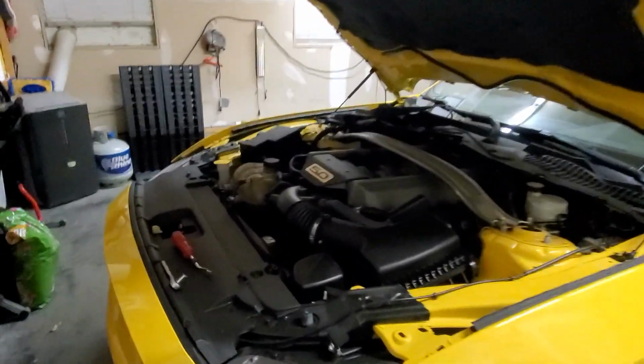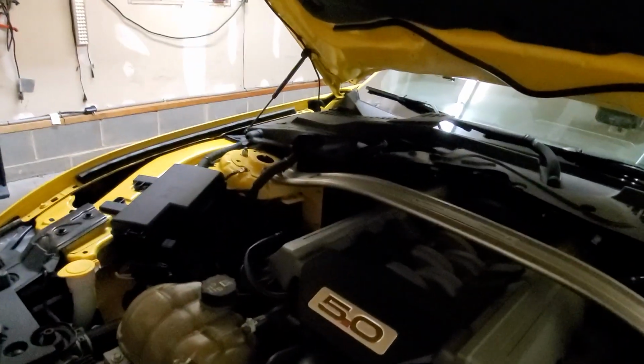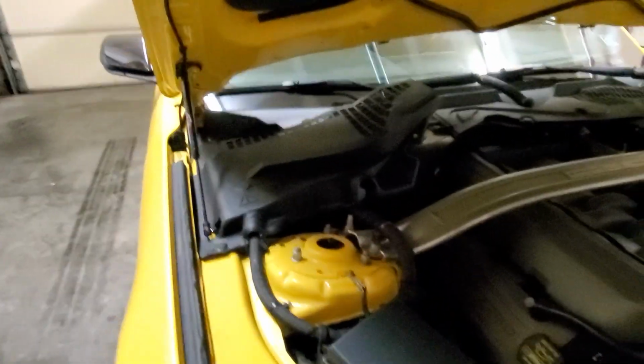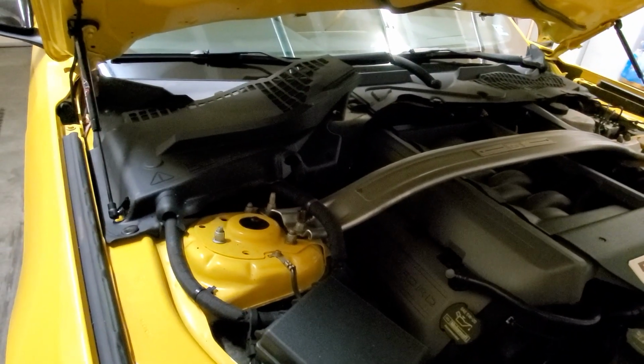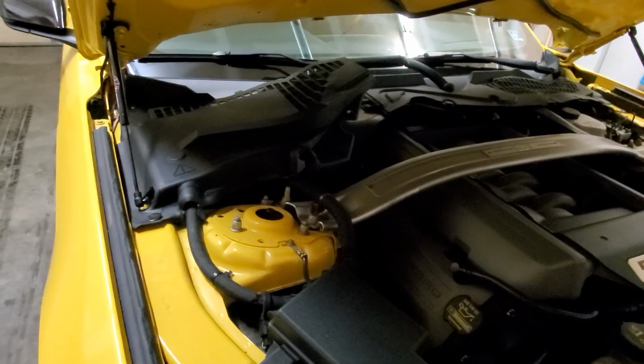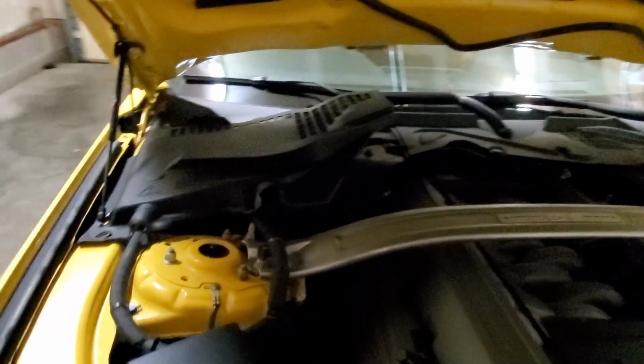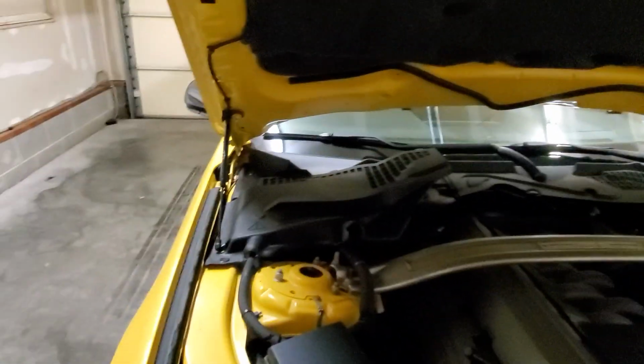Alright, that is what we're doing surgery on. The first thing you want to do, and there are no directions for it, so you just look it up and go about your business, is disconnect the negative on the power, because you are going to be messing with the electrical system of the car. Brandon has already done it, I think. Well, he took off the positive, not the negative, but whatever, we will have no power. We will get inside the car and start tearing things apart, and we'll hit you up as we go along.